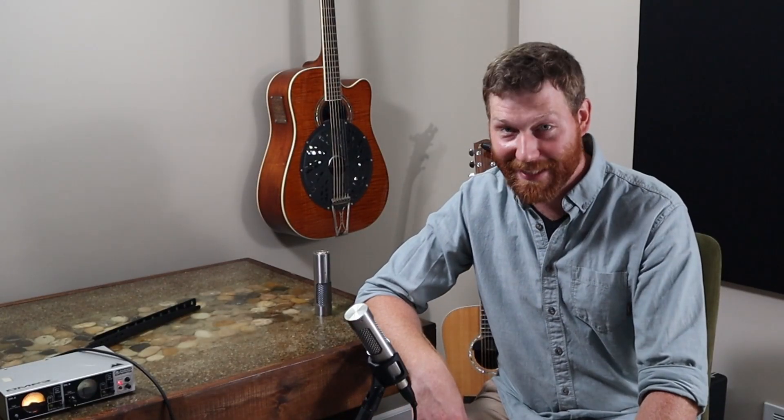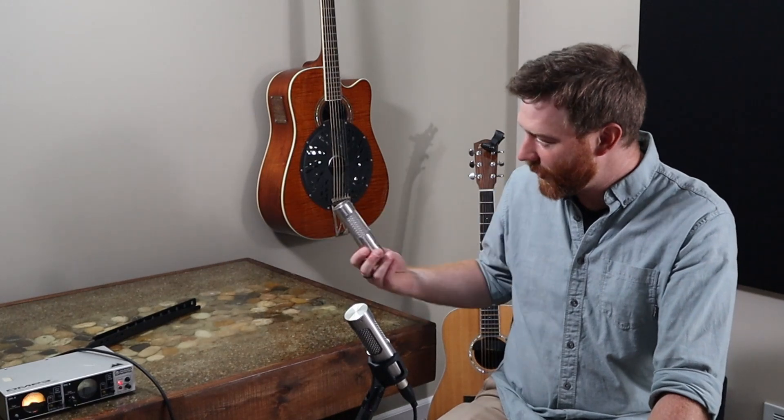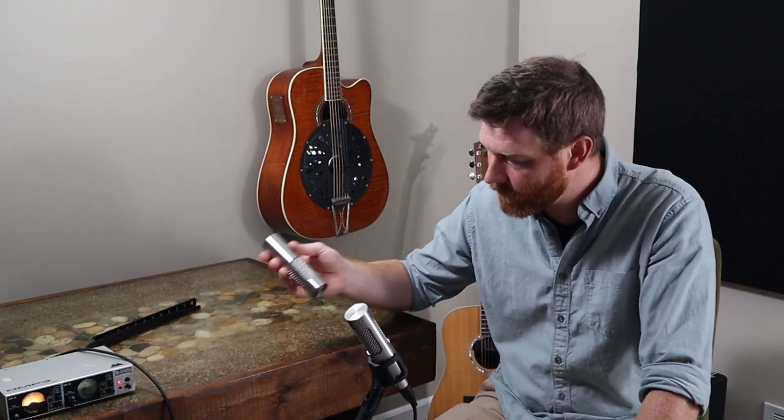Alright, now I just had to go take a look at that clip, and man, that made me cringe. Watching that mic fall — I've just always been taught to respect ribbon mics so much. Watching that mic crash onto the table was just really unnatural. But the mic is right here, and I've actually completely disassembled it. I took a look inside and I see no bowing or bending of the ribbon at all. I also see no attenuation in the signal. That's what happens when a ribbon stretches out of shape — it bows and goes outside of the core magnetic field in the capsule. You see an attenuation, so you'll get less output. And this mic is really performing just as it did before that drop.